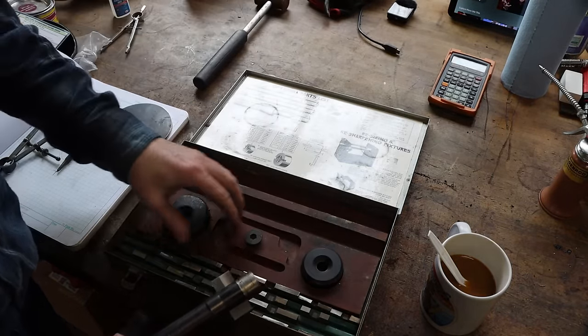So let me show you what I gotta do to finish this thing up. I drilled a hole in there, and that hole is for a plug weld, so I can weld a slug of this 2-inch material to the back of this flange, and that way when it's bolted down, it completely fills this hole, because this is a ball mill and it's gonna rotate a gazillion and a half times, sometimes weeks at a time. We don't want the balls, this is what I was asked to do, we don't want the balls to get in the hole and potentially beat up the leading edge of this, and to keep that from happening, I'm going to turn down a slug of this material, about 200 thousandths off, so this fits in there.